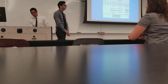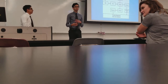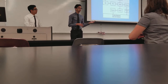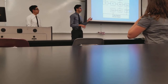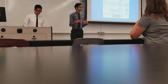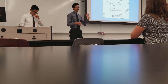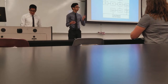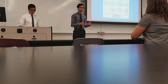This is the block diagram showing how it works. You start in the upper left with the user input — either pressing a button on our HMI or talking to the Amazon Echo. If you press a button, it talks to our PLC, which is already equipped with ladder logic to hold the output state. Then our microcontroller knows which product is wanted, starts our PWM, sends that pin signal to our stepper drivers, and that moves the steppers to bring in your product.